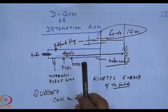Using a combination of the HVOF spray and the detonation gun, very specific coatings can be generated using powders, solutions, even wires. Like molybdenum wire coatings are required at many places. In such cases, most cases, it would be a detonation gun if you have one, or the high velocity oxygen fuel spray.